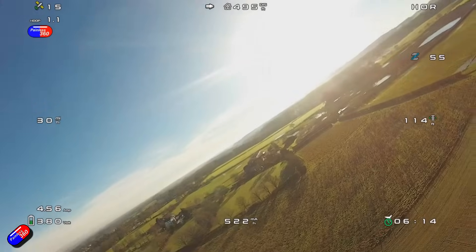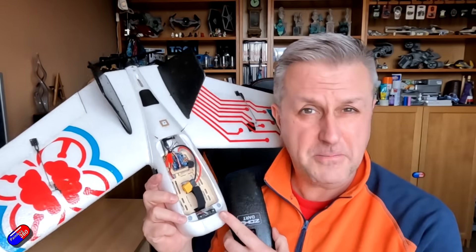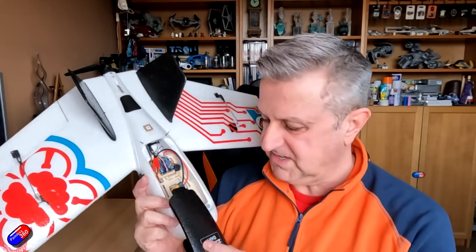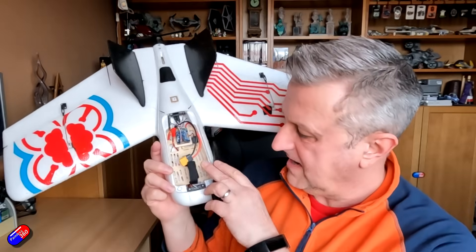However, because this plane is so incredibly efficient, it doesn't pull an awful lot of current — so lithium-ion batteries could be an option. There's quite a lot of room in front of the flight controller. So I thought, let me see if I can get a 3S lithium-ion pack in here. If I could work out a way not to add too much weight, and maybe position it right, I might have to cut a slot because the battery hatch itself isn't particularly deep. I'll have a look and see how that goes.